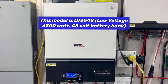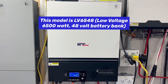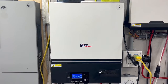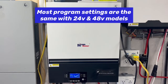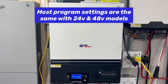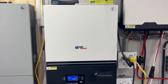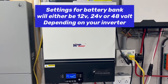This inverter is really particular about how many panels and the way you string them together. In the owner's manual, it'll show you that you should be stringing these in series, either in 3, 6, 8, or 12. The 8 would be for the 3000-watt, or you could use 3 or 6 in series — you wouldn't do 8 in series on this one; that would be just the 3000-watt.